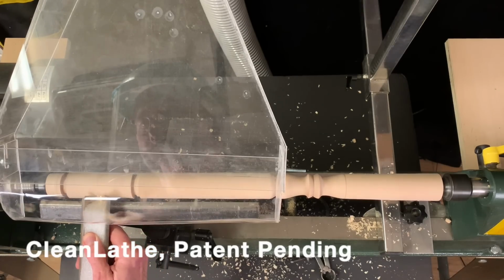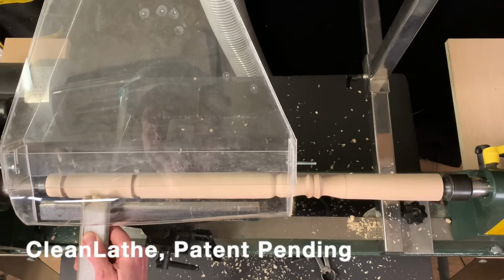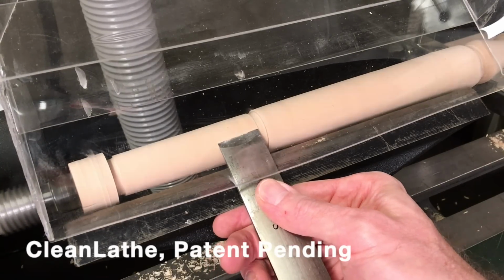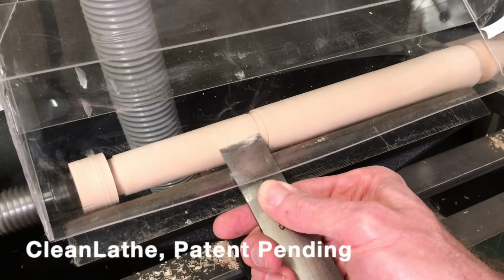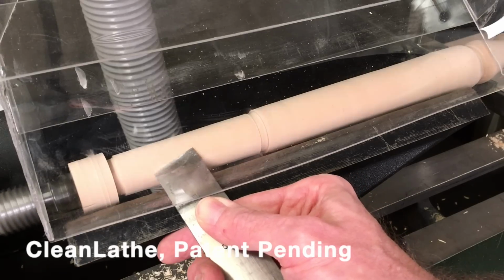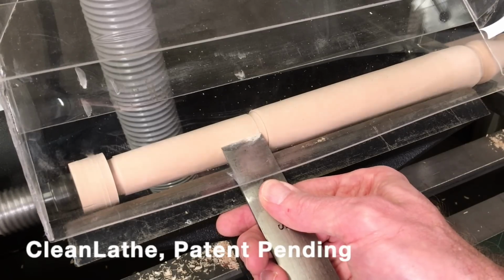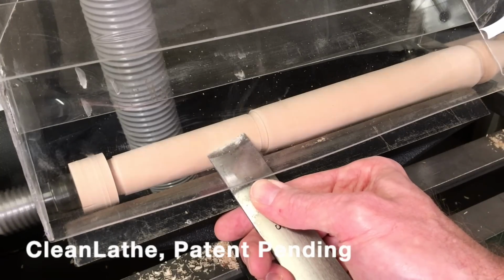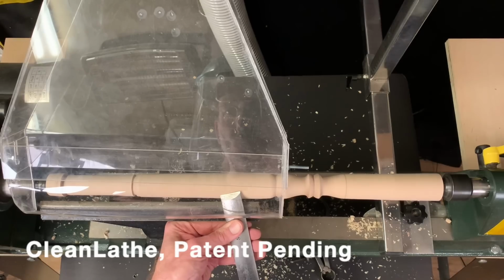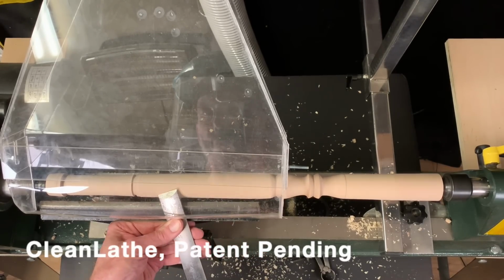Now, woodturning is one of my newer skills in the workshop. I've taken a few classes on how to do this, and I've gotten some experience with different tools. But the one tool that I fear the most is the skew chisel. That's the one I've got here. The skew is great for making these flat areas on a turning. You can also use it in very versatile ways. But it's something that I fear because I've used it a number of times and messed up turnings. And when you mess up a turning, you typically have to start from scratch again. So I just use it very, very carefully. So I'll go across this and just skim off the surface, get it as flat as I can to avoid what's called a catch.